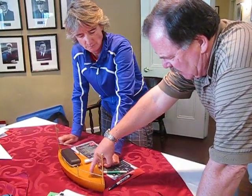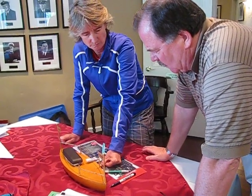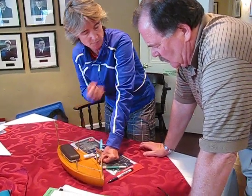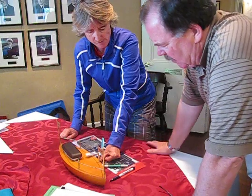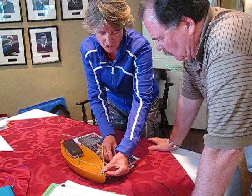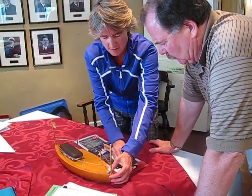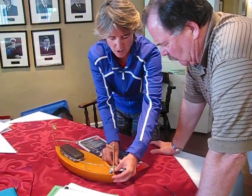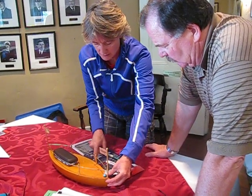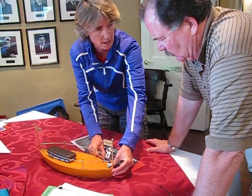One person — the helmsman could be handling the stern line. That line can go down around a cleat, back up onto there, and they could be pulling it tighter and tighter. The other person's going to be on the dock. I could also take a line from there and bring it more to here to help pull in. I could be handling these two lines, because often there's a cleat there — a cleat there, a cleat there, and a cleat here.